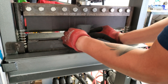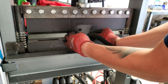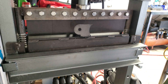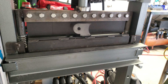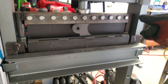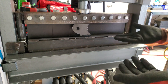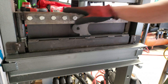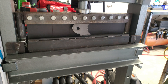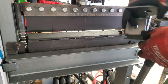Let's go ahead and load it up for that second bend and you'll see what I mean. So, we're not even all the way at 90 degrees — in fact, we're probably about 35 degrees — and we're running into interference here. That's why I have the relief cut. If I had gooseneck dies, this would be a non-issue, but since I don't, I'll use the relief cut so I could finish the bend on my vise. By having that relief cut, it also helps me know where my line is and go straight from there, so it's square.